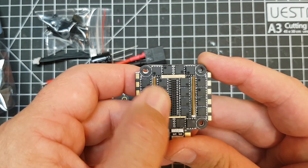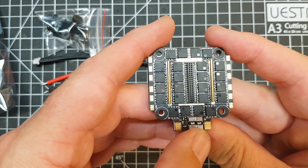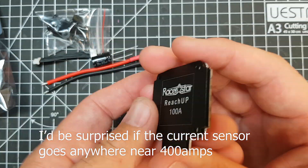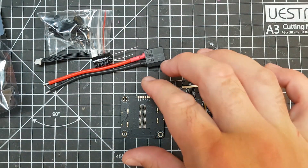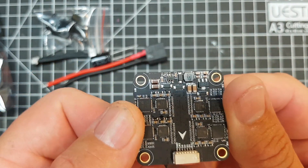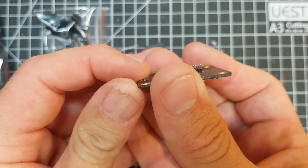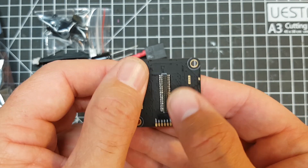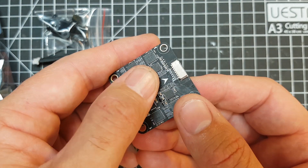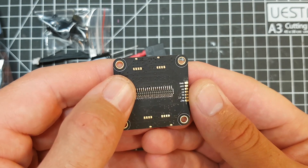On the top you can see the usual business — got analog current sensors here, and this is obviously BL32 up to DSHOT 1200. Then on this other board we have essentially the connector and additional capacitors. This connector board is completely flat as well, and there's nothing fancy on this particular ESC — it's got no regulators or anything like that, so you've essentially got ground, current, and signal.